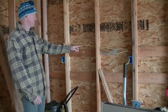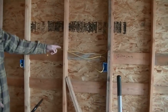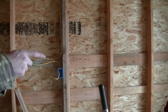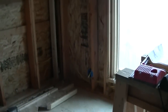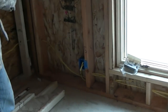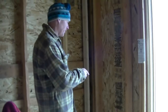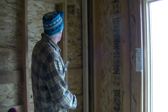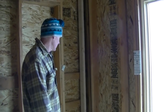Outlets three and four are going to be on one circuit as well — I still have to buy more wire to run it the rest of the way. The oven is going to be gas, so that'll be on a separate 20-amp circuit. I have to look up whether I can put the gas oven and the vent hood on the same circuit, which would be convenient.